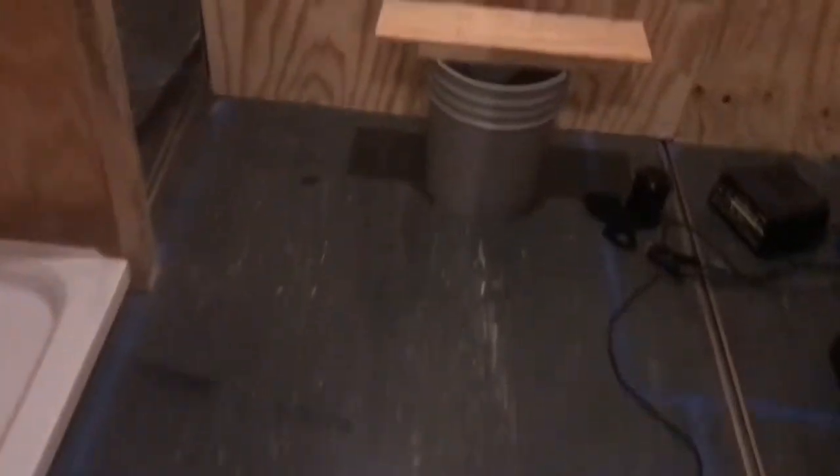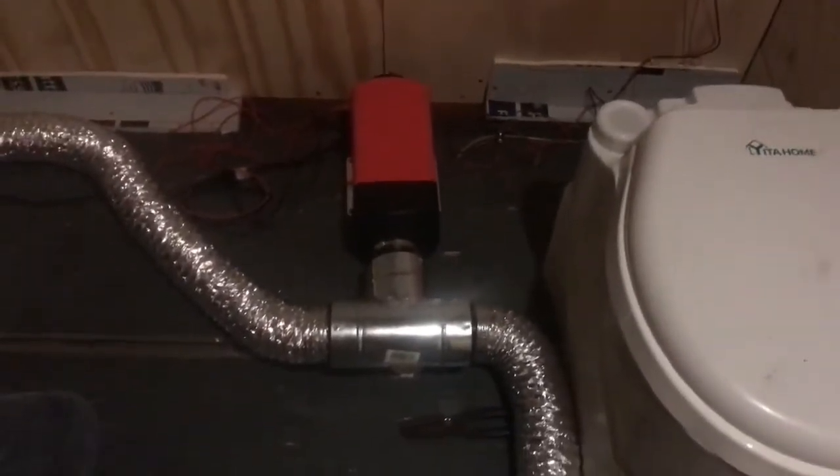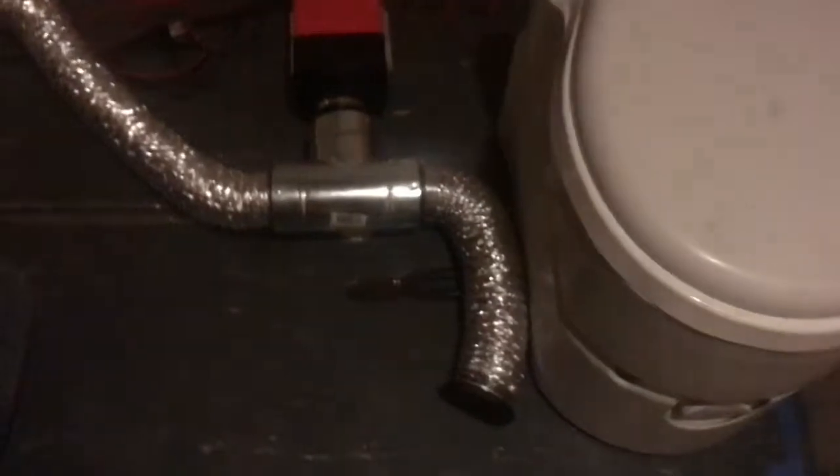This is the middle room, the daughter slash guest room. This heater here — I got it set up to heat the back half of the bus. This vent right here is one of those ones that opens and closes. When you want heat in this room you open it, and when nobody's here — just me and my wife rolling — we'll just close that off. I got it coming out of the diesel heater into a tee: what goes into this side heats this room, and what goes into the other side goes through the wall and into the master bedroom.